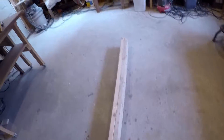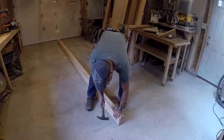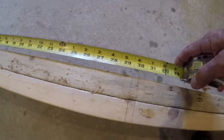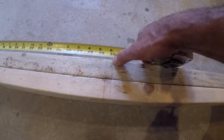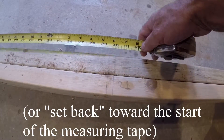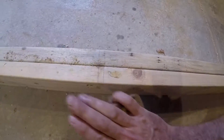There are some marks already on there from the last boat I built, which is similar to this one. I'm going to put a nail in here to measure back off of. From the bow back we should have the first rib at two and a half feet — two feet six. I'm going to make these ribs out of half-inch material. I want the widest piece of it to be on the mark and set forward, because I've calculated the curves to this point to be at a certain width.